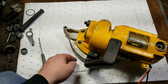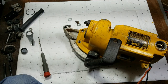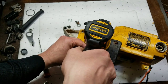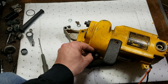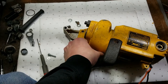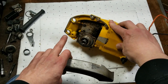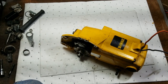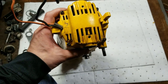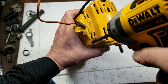Getting this outer guard off, we have a few different fasteners - a couple of 5/16 bolts and a couple Phillips head screws. Some of these don't look like DeWalt's factory silver fasteners - they kind of look like somebody's afterthought, like somebody lost them and put on different fasteners. Here's our top plate, held in by a cross through the body - two screws up here and then two larger bolts. Getting the back part of the motor off - a couple little grub screws hold in the brushes, which are usually pretty tight on these types of tools.